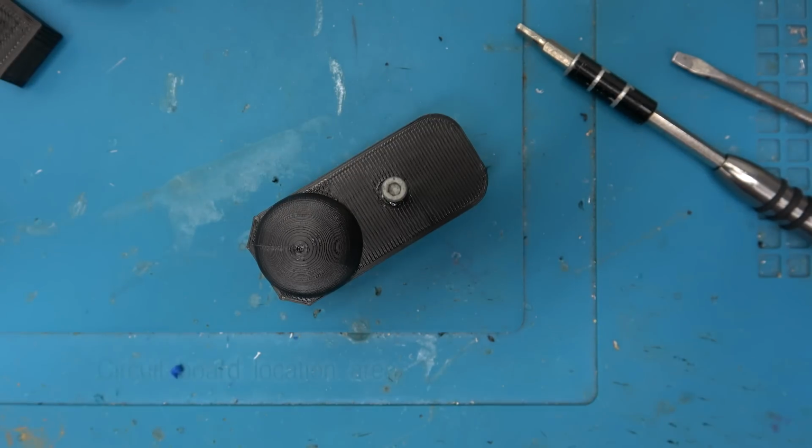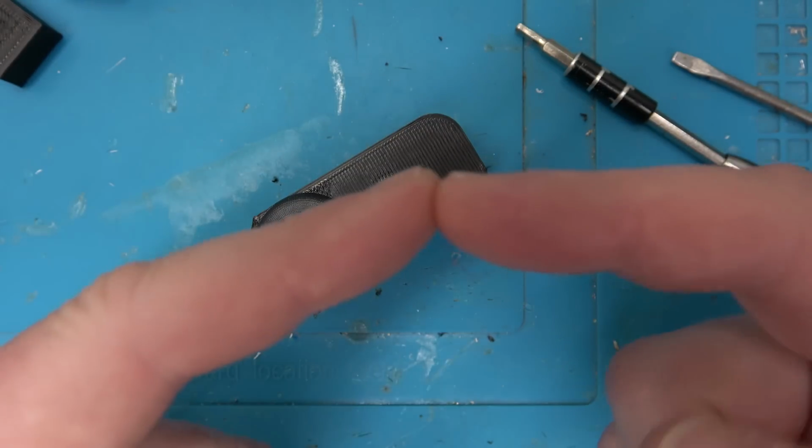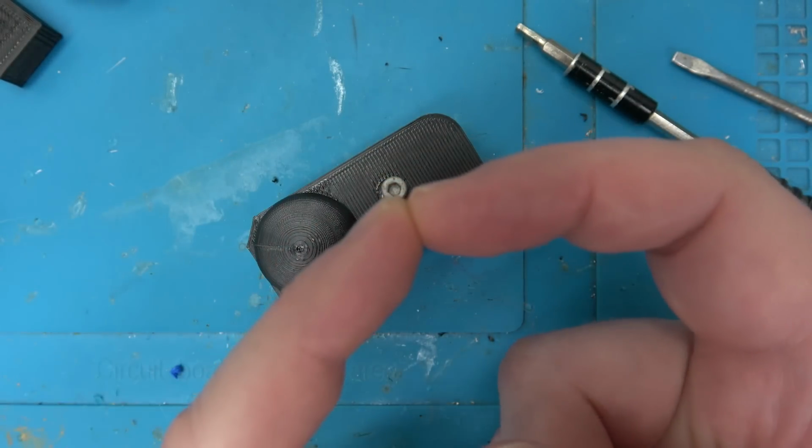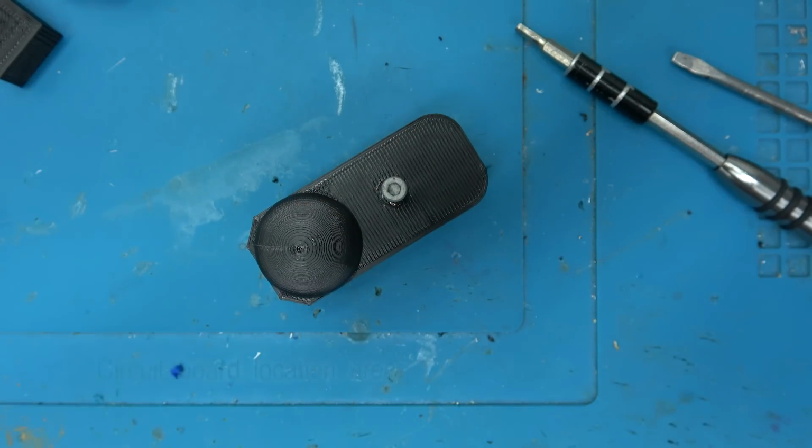But then it's like, oh, the energy chain is right here. Let's put the tube in it. Well, actually, if the tube is constantly compressing and decompressing, that could also create stress points. Well, not stress points, but compression points that could add friction. That tube is only about a quarter of a millimeter larger than the filament itself. So even if the tube is really slippery, if you have enough bend over time, it will add friction, not just that thing on the end.